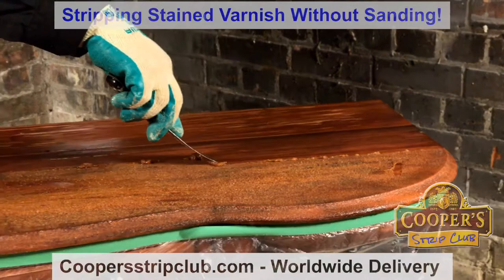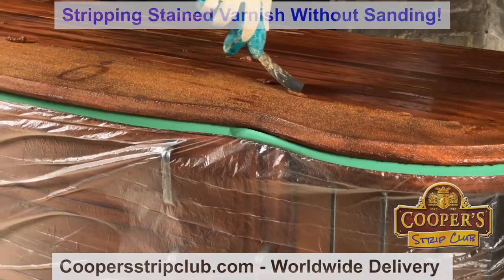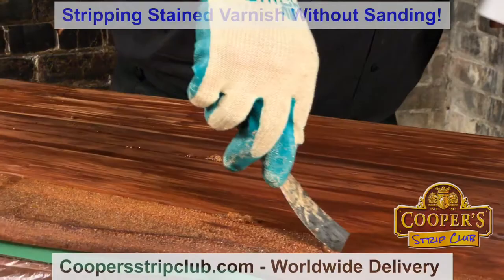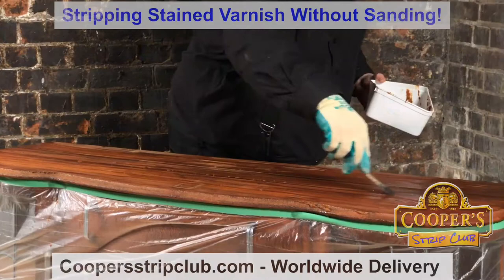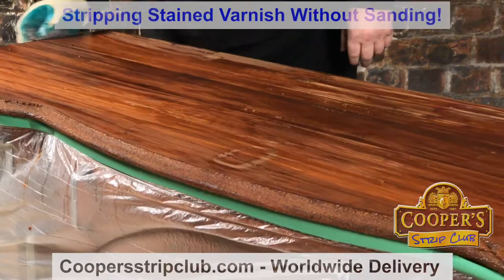You can use wider blades but you've got to be careful because if the surface has any warps in it, you're going to potentially gouge into it. The container is quite good to scoop the goo off into as you go — keeps the mess down. We tend to ignore any of the wet marks initially. I always drag rather than scoop because there's less chance of digging into the wood. If you're scooping, it's really easy to bang into things.